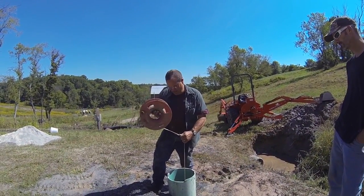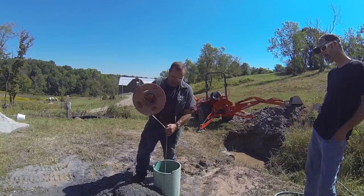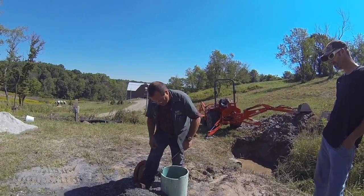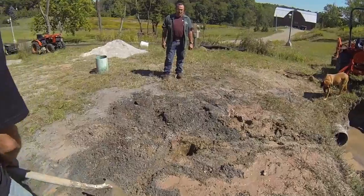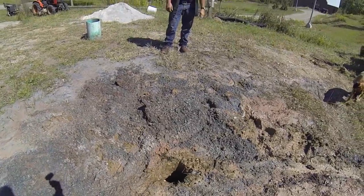Once the well has been drilled, it is measured to determine its actual depth and the depth of the groundwater table. In this well, the water table was found to be 60 feet from the surface, leaving us with 140 feet of water in the bore. This well has only 5 feet of soil or overburden, which did not require a surface pipe, also referred to as casing.